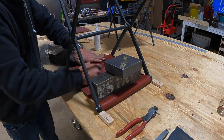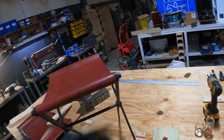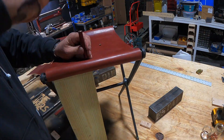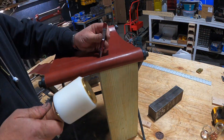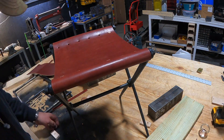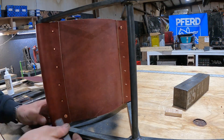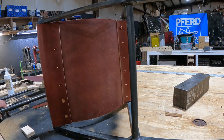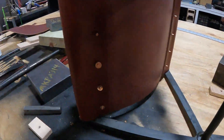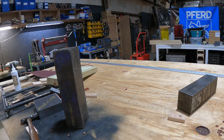I have small chunks — about five by five by inch-and-a-half thick — and I have all different shapes: rounds, tubes. They mostly just provide clamping power, stopping power, and hammering power for any project. To punch that hole I had to elevate the table up in the air with a two-by-six piece, otherwise it certainly couldn't have punched the hole. Here I'm getting experimental, gluing each one of the rivets in — just to see if I could save time on the second version of assembly. I tried tapping them together gently and then driving them home, but honestly it really didn't save time. I spent a lot of anxiety fumbling around keeping rivets from dropping, so by the third stool I just went back to the original assembly process.